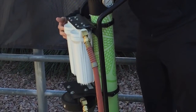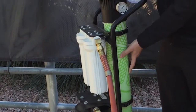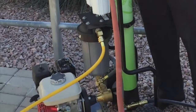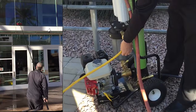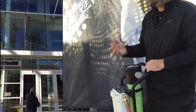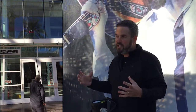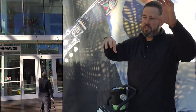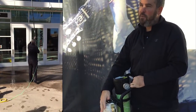After it runs through these series of filters, it gets pushed down through the motor and then forced up through this reverse osmosis chamber, which kind of changes the molecular structure of the water. Then the last step is going through this DI resin, which takes out those last few microns of particles in the water, and then it comes out ready to clean your windows. Simply put, this unit takes the water out of its natural state, so it becomes hungry to get back to its natural state — when it's on those windows cleaning, it's grabbing all those soils and minerals, wanting to get back to its natural state. Really, this unit is just making that water hungry to clean.